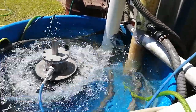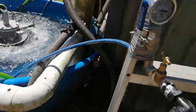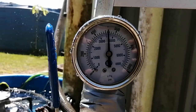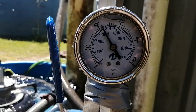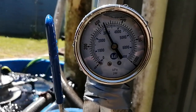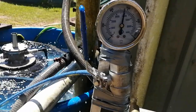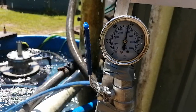We're running on them probably around 3 or 4 litres a second, pumping up to under 800 psi, but we're only pumping to 400 metres. You can see the pump in the background as the water's running down around us from the overflow of the stand pipe.